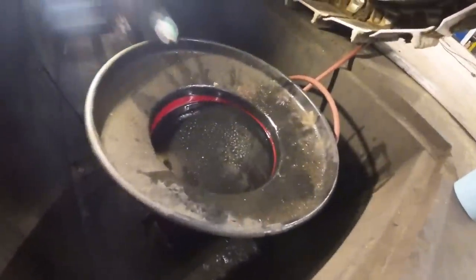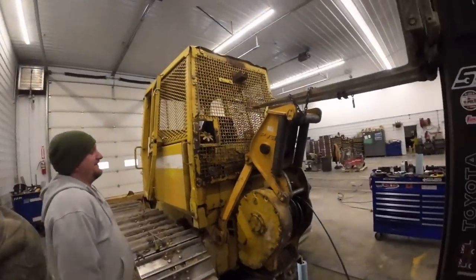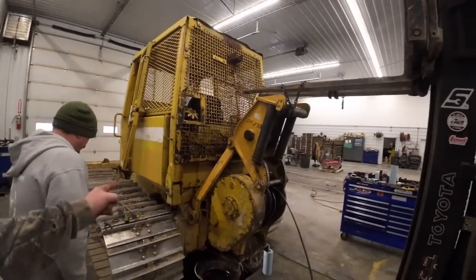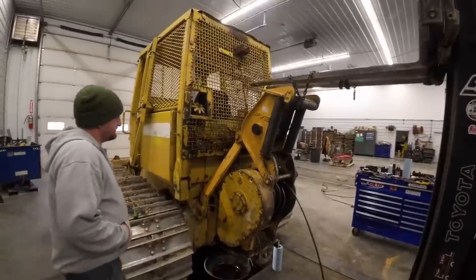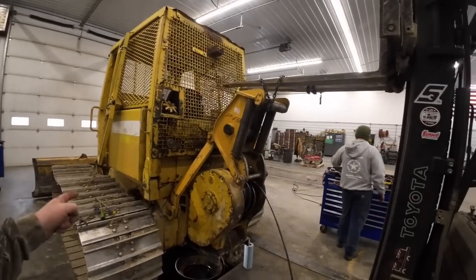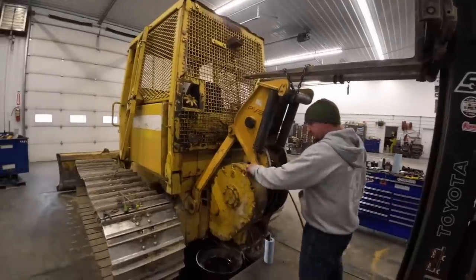That's mechanic glitter. The oil should be a light tan, brownish color and clean. The brake adjuster is all the way up, but the customer says he keeps adjusting it and it's wearing out quickly — it doesn't last three or four passes before it needs adjusting again. So either something's come apart, the linings are gone, or it's just worn out.